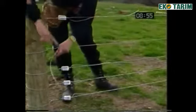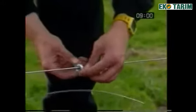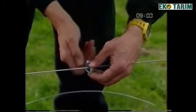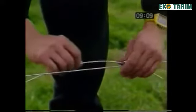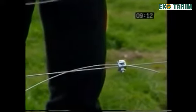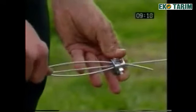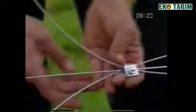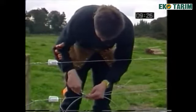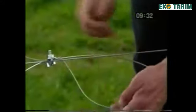Now you must connect the wires in parallel. Attach the Gallagher joint clamp to the second wire. Now connect the tails from the top and the third wire using the Gallagher joint clamp. Ensure that this is firmly tightened. The excess wire can then be wrapped and broken for a smooth, tidy finish.